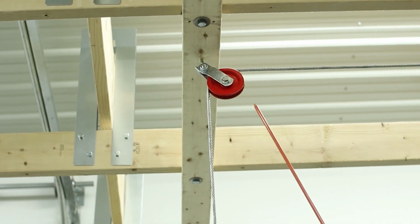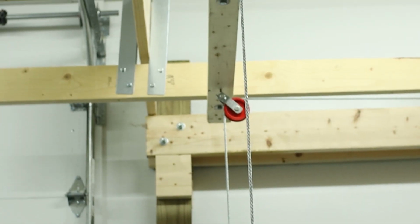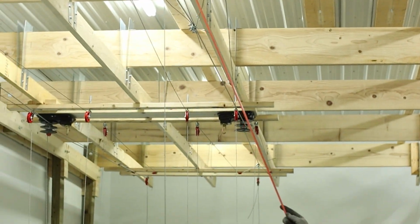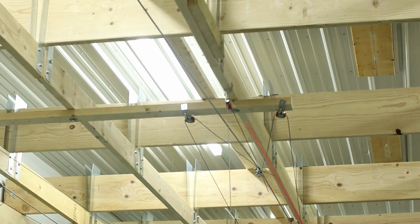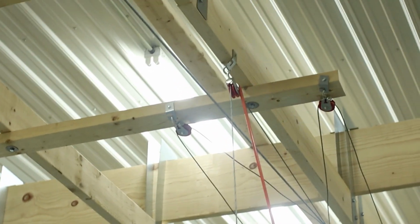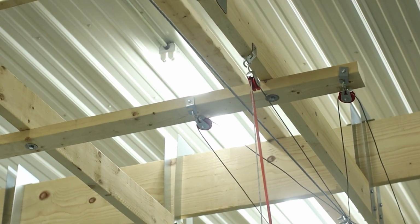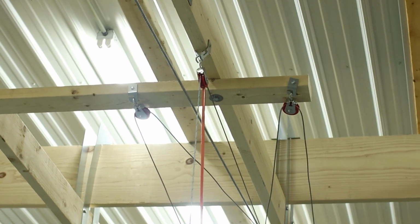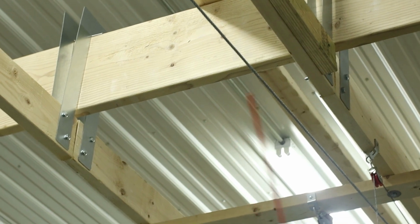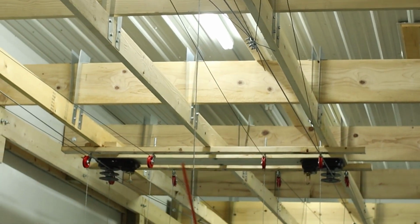As we stated earlier, these pulleys are going to be 48 inches apart so that they hang straight above the corners like we talked about earlier. And then your pulleys down to the trough. When you put these on, you want to put them alternate. If you have a long system, I only have one in this short system for demo. You would put these 3 inches alternating on each side of the home run line. So this one would be 3 inches on this side. The next one, if I had one, would be on this side, and we'd alternate going down through the home run line. That'll keep your home run line straight.